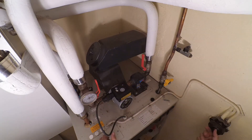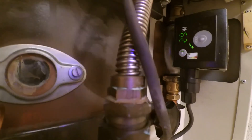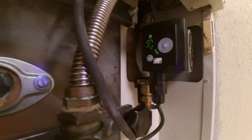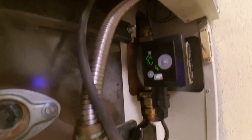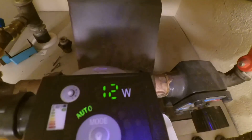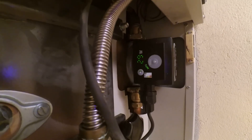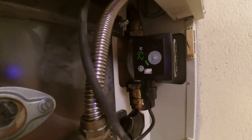I'm now going to turn off the power and switch the internal pump — I won't film that part because I'll be ramming my hands into tight spaces and might say a lot of dirty words. And that is in place. After a bit of work I've switched out the other pump too. It's now running at 28–29 watts, and the other one up here is at 12 watts. Compared to the old pumps, I'm saving something close to 900 kilowatt-hours per year.